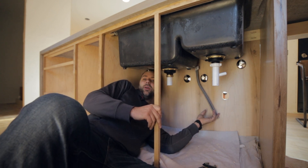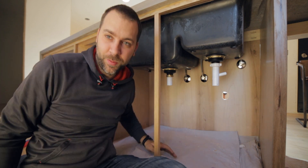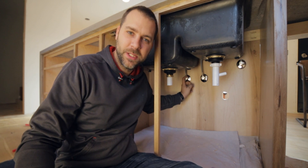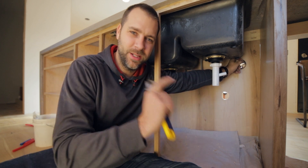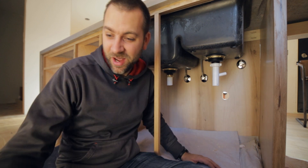Like I said, access is the best part of plumbing. This one over here is a little atypical — this is for my dishwasher. Typically you just tee off of the hot water from the sink and run into your dishwasher, but I actually didn't have the parts for that. But I did have extra parts to run a new home run all the way back to my manifold. So now my dishwasher will have its own unique connection. Might be kind of nice in that I can get full hot water capacity to both my sink and my dishwasher at the same time.